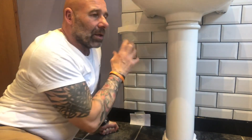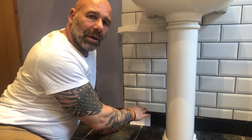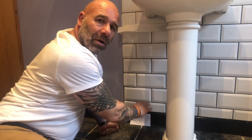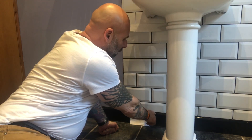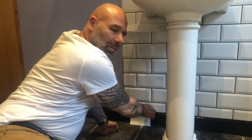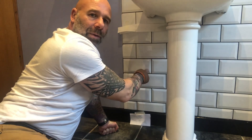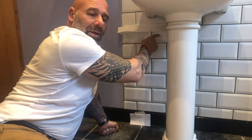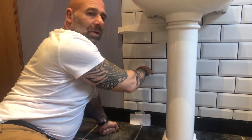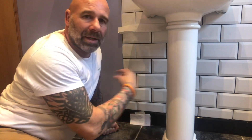You hack your plaster off, you drill and inject your damp proof course. Once that damp proof course has been drilled and injected, from that point on there's no more water from the ground that's going to come up through it. But the water that's left in your brickwork — which is up in the capillaries above the DPC — continues to rise and evaporate out where your salt band is, until all that moisture in your brickwork is gone and the wall returns to what we call equilibrium with its surroundings.